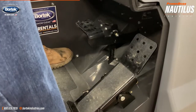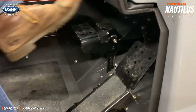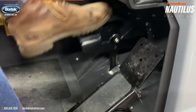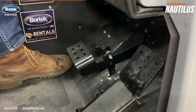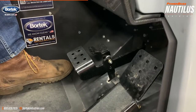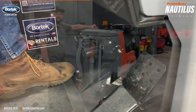The parking brake feature is very important — operate this correctly. Operating the machine with the parking brake on can damage components. To apply the parking brake, you want to press both pedals at the same time. That depresses the parking brake, making the machine unable to be moved. If you were to drive around with the parking brake on, it does overheat your drive motor and can create problems. To release the parking brake, all you have to do is depress the one pedal and it'll automatically lift up.